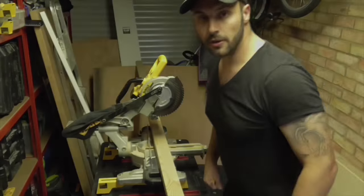I'm going to use red plugs — these are the little creatures here. They go in a 6mm hole. I get these from Screwfix — I think they're by a firm called Uno. They're really good because they've got a little lip on them so they don't go too far in, which can be a bit of a problem with other plugs. I'm a bit careless sometimes and make the hole too deep, so these red ones with the lip are ideal.